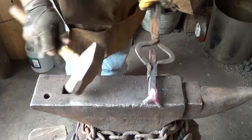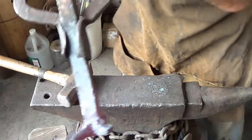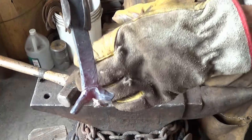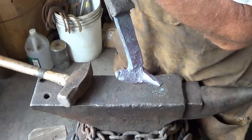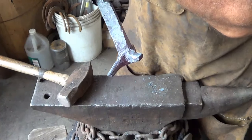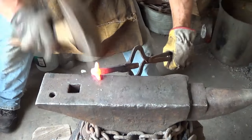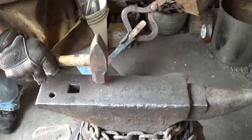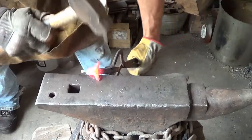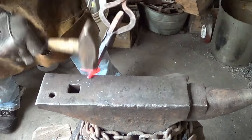You don't need to steal a lot here - there's a lot of steel in there to make that horn, it doesn't have to be much longer than it is. I just kind of clean that up so where it comes into the head it's more proportionate. Let's do the other side now. Once you do a few of these you kind of get an idea of where you can hit and where you can't hit. You don't have a lot of room to work. I like using the three-pound hammer even though it's a little bit on the heavy side to get into that corner - it does the trick once you get used to it.